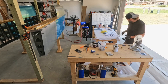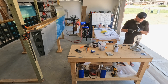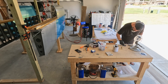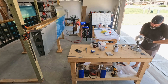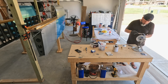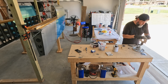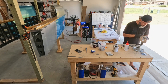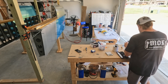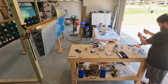Why aggravate your life? I think I would have spent a lot of time and been unhappy with results if I had created that fuel pickup myself — worried about the dimensions, the bend, and everything. Is it clean once I crimped it closed and cut slots in it for fuel to come in, when Van's makes ones that are already perfect? So do that — 16 bucks. There's enough work on this plane that buying their fuel pickup won't cause you to fall below that 51% rule for experimental aircraft.